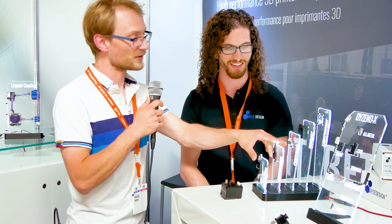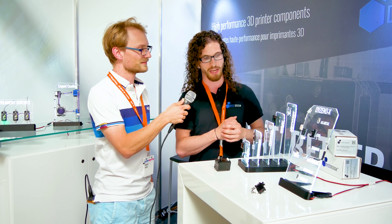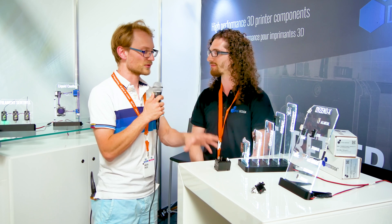You also have a special tooth profile on your hobbed gears. Instead of using a tap, which makes very deep and sharp teeth, we prefer using a standard end mill tool, which makes a bit wider, more open teeth. So it's a much cleaner operation in general, and you would never need to go in and clean those.